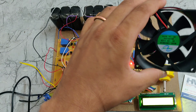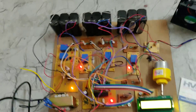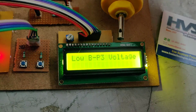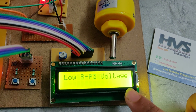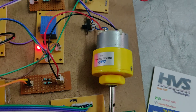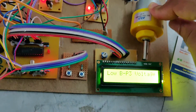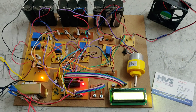The fan gets switched off because the temperature decreases. Also, if you want to see the current in amps on the LCD display, we can see zero amperes when the switch is off. When I turn it on, you can see the motor rotating and the amperage shown on the LCD. We connected a motor as a load in series, and through the series connection we are calculating the current using the current sensor, which is processed by the PIC microcontroller. That is how this system works — thanks for watching.